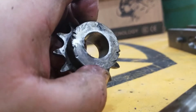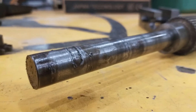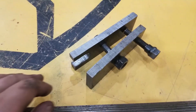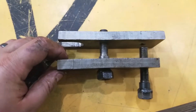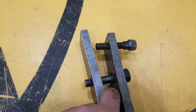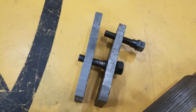I'll put the shaft in the lathe and clean it up — it looks like several people have tried to remove this before, judging by the marks. I'll build the shaft up and turn it back down nice and smooth, then machine a proper surface, and I might even add a keyway. The tool did the job despite the limited space. It did bend the bolt slightly — you can see a curve — but that's because I had to use mild steel; the shop gave me half-inch 13 coarse-threaded instead of half-inch 20 fine, so I made my own rods with a welded nut on each end. That did the trick.